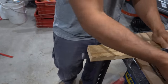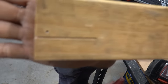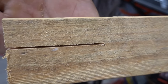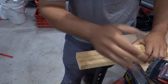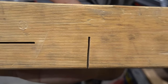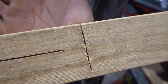I'll show you a demonstration - we'll cut with the grain first. Looking at the back: we've got a nice clean cut there. As we come up to the top, because we cut with the grain, you don't have as much tear out or blowout - it's actually pretty good. Now cutting quickly across the grain: once again the bottom is nice and clean, but as it comes up to the top where it exits, that's where it splits the fibers and blows out.